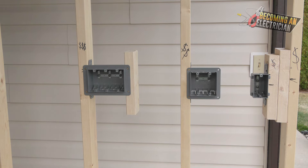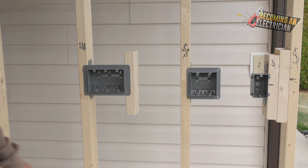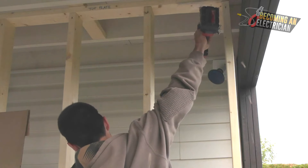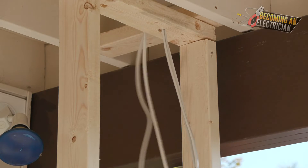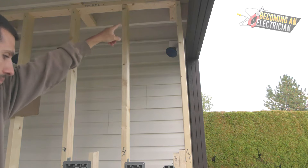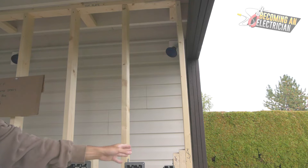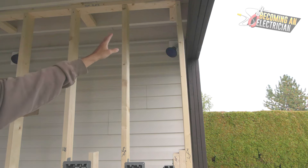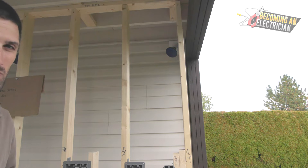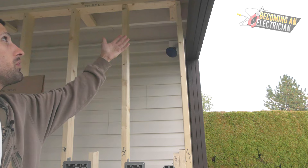Let's get into actually drilling a couple of holes. I'm going to install this plug just a little bit over to show you how it should kind of look. Usually the first place to start when drilling holes is from our top plate, because the top plate is usually where power is coming from. We leave the panel, it goes through the joists or however you're getting it — usually in the ceiling — and then it's going to drop down into our top plates. You really want to think about all the wires coming down because power comes in, but power also leaves from your top plate many times. So let's say one hole has three 14/2s — power in, power out, and a switch leg going to a light.